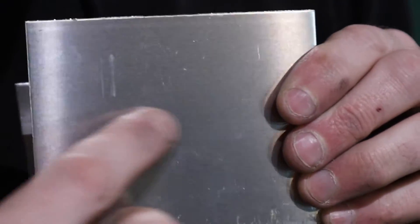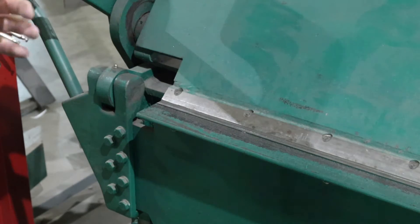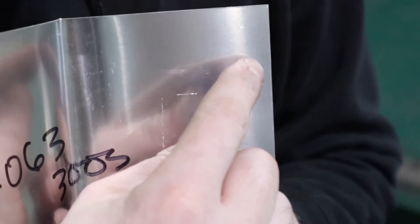Let's see if I can get the grain structure in here — grain's going this way, and the bend is going this way, with the grain. And that actually just stress cracked right there when pulling it back out. So if you're going to put a bend in there and leave it, it'll be fine. But if you're bending with the grain you just need to know there's a possibility of breaking. This one here — the grain is going this way so I'm going against the grain.